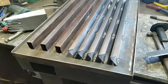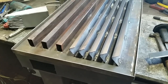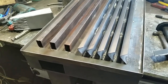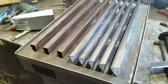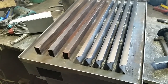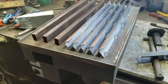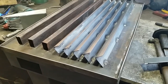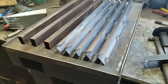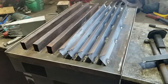Here you can see two different types of heat transference. These radiator fins were made at two separate times because I don't buy material — I have to wait until it falls into my lap. Luckily I've got a mate with a sheet metal shop who allowed me in to pick up some scraps from behind the guillotine, put a fold in them and weld them onto the bottom of here.